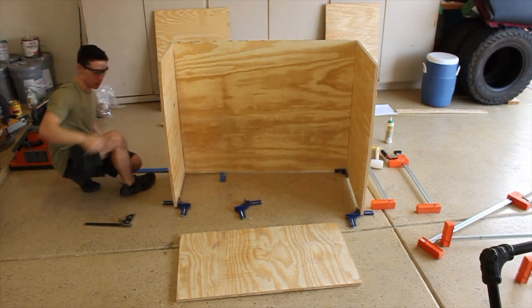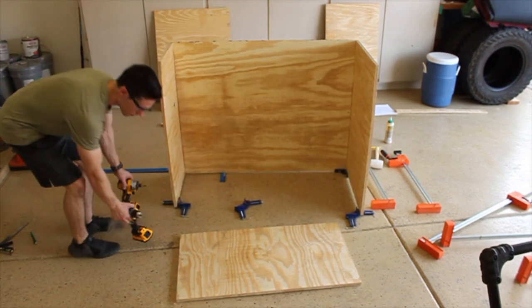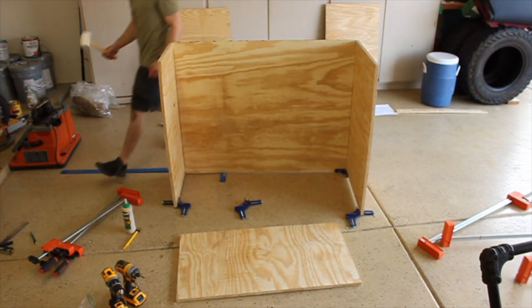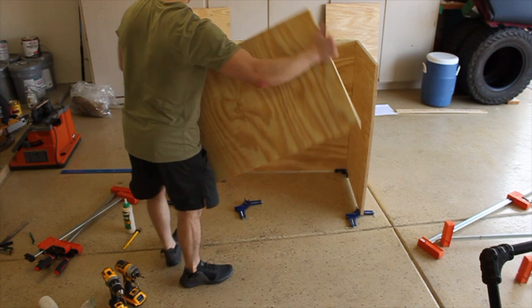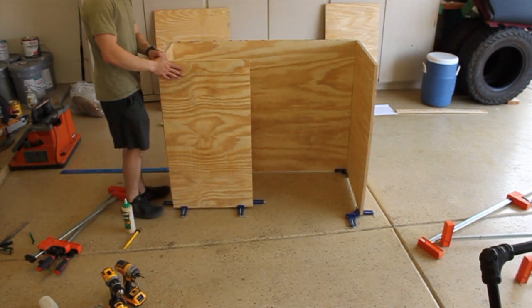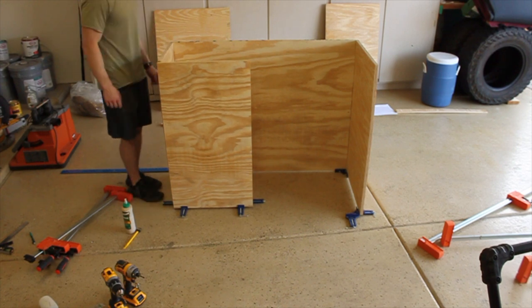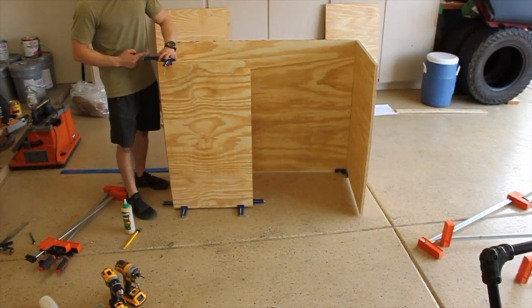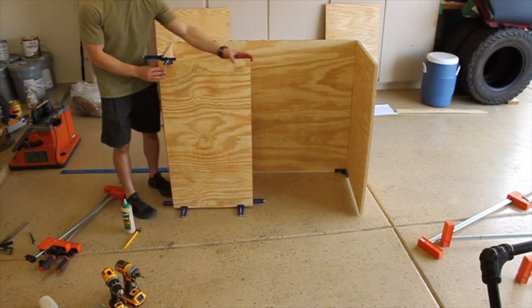It was a simple glue up, but my clamps kept getting jammed, my cut pieces were bowed, and I messed up by clamping with the concave side towards my glue edge. If I had clamped the bowed pieces with the convex side down towards the glue edge, the boards would have acted as their own clamps and would have made the process way easier. Either way, the piece still came together.